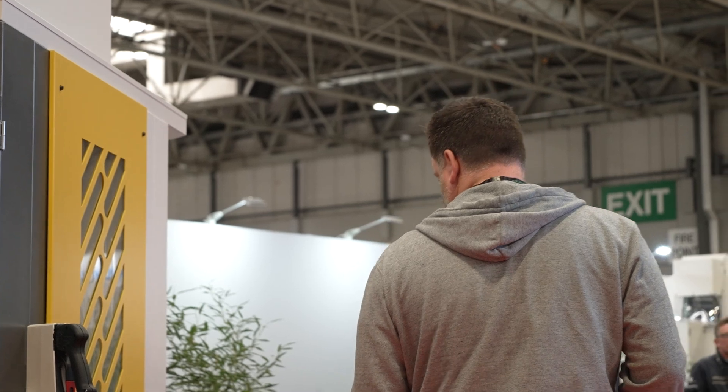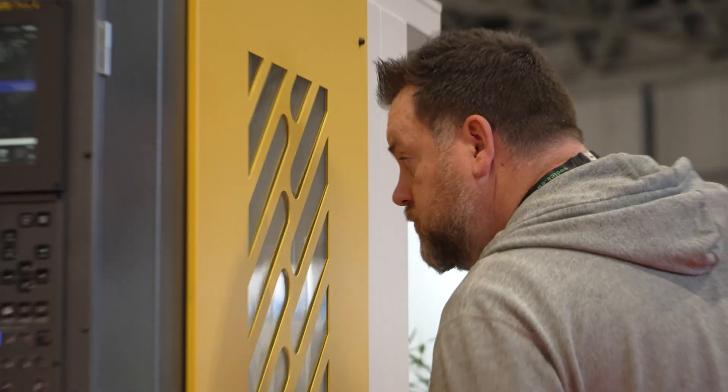Now let's talk about how the turning application makes the machine more productive and opens it up to new sectors. In its standard form the RoboDrill is a three-axis VMC — a fully fledged milling platform capable of very heavy milling. Adding the turning table has opened up the whole world. We've got a fast and efficient machine coupled with an extremely robust Nikken table, oil cooled, so we can run it at 1,500 RPM all day long, and couple it with five-axis milling as well.